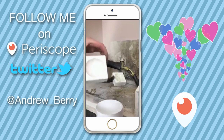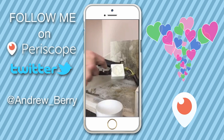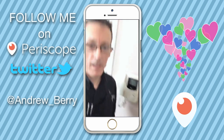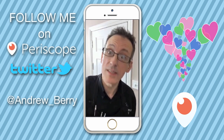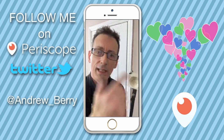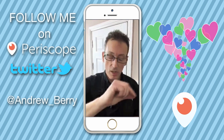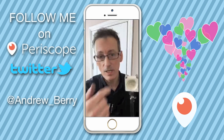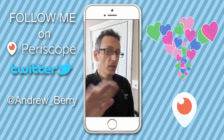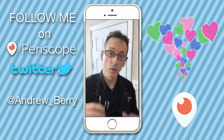If you compare that with this one, there's nothing shiny at the bottom of that one, but now we've started to get a nice coating along the bottom. That's all there is to it. You'd spend a little bit longer heating up the crucible, making sure the surface is nice and hot, sprinkle or paint the borax across the whole area, and then you've prepared the crucible and can safely start to melt your silver or your gold.